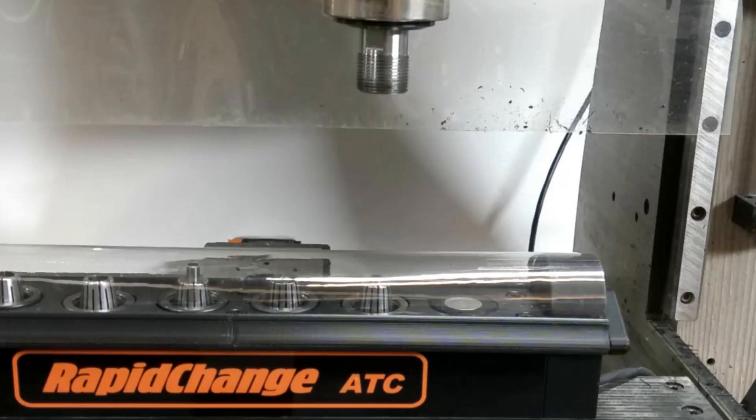I designed the clearance holes in the cap to be 0.4 mm larger in diameter than the clamping nut. So if the nut rubs on the side of the clearance hole, there will be an audible alarm to let you know that alignment has been disturbed. I will demonstrate a couple of failures.